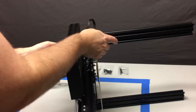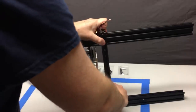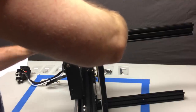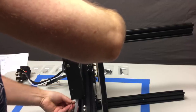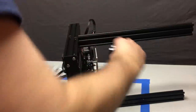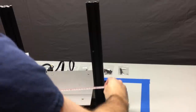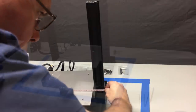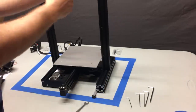The slightest deviation in tightening the screws can kick these things out a lot at the top. More often than not it's going to be the one on the left — all three I've done it's always been the left-hand one. I'm going to loosen them slightly a half turn, then tighten the screw towards the center a little bit more to hunker that side down and bring it in. I had about a turn left to do on that one, and I'm tightening the inner screw maybe an eighth of a turn more than the outer.